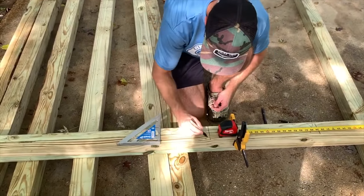There's a smaller 2x2 panel and I'm getting the underlap edge so it's positioned towards the top, and then I'm installing nails every 8 inches on center, and then I'm positioning the overlap edge of the 4x2 panel on top of the underlap edge of the panel we installed below, and then I'm making sure that it's flush on the outside corner as well. Here I am doing the same thing for the other side.